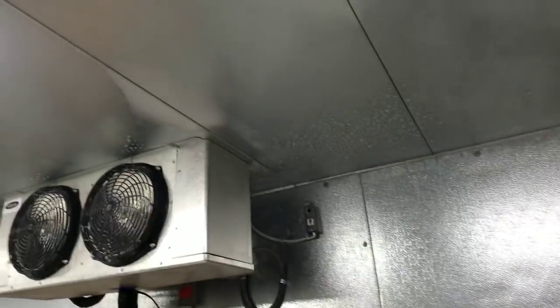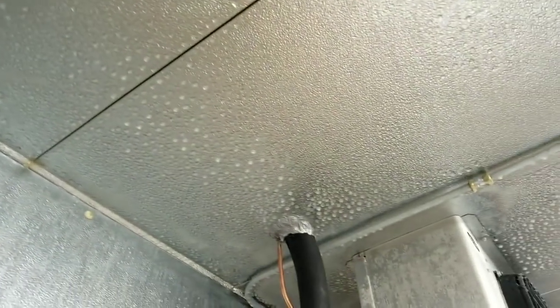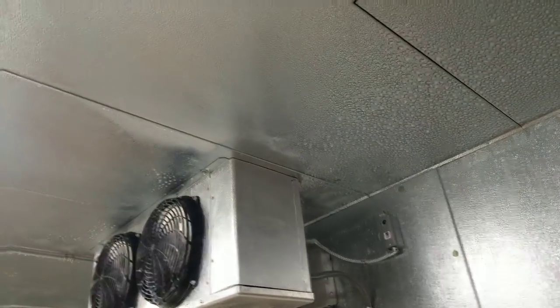This is the follow-up video — it's been about four days since my last visit. Almost as I predicted, that defrost clock set to the same time isn't really doing any good. We're starting to get the frost buildup again, coming in through the seams. We're also getting the telltale signs of over-defrosting: little droplets hanging down and freezing. I'm going to go back to the manufacturer and tell them what they asked me to do isn't working.